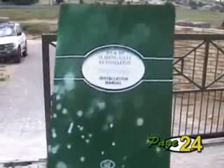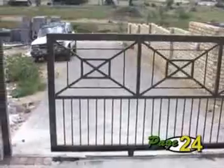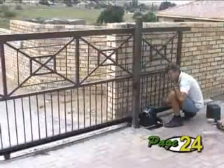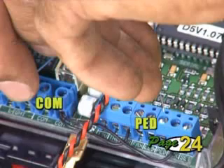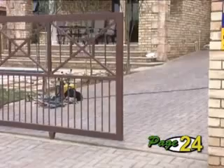The automatic setup routine is shown in detail in the manual. During the last cycle, the gate reverses at full speed and stops in the pedestrian position. You can widen the pedestrian opening by shorting across the inputs marked PED and Common on the terminal blocks with a short piece of wire.